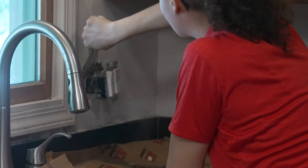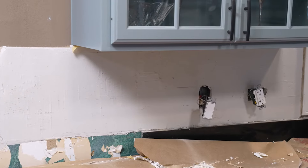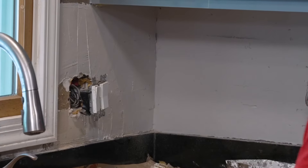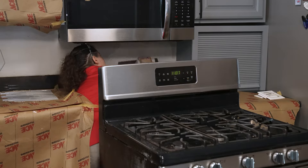To get started, make sure your wall is as smooth as possible. Next, start planning out the tile installation — which side of the room you're going to start on — and look at what obstacles you'll encounter, such as varying heights of the upper cabinets, outlets, corners, and so on. For this backsplash, we're starting behind the oven, and we'll work right to left.